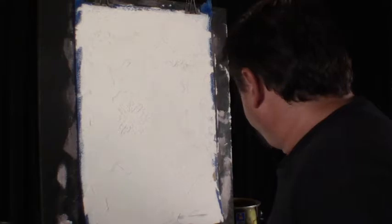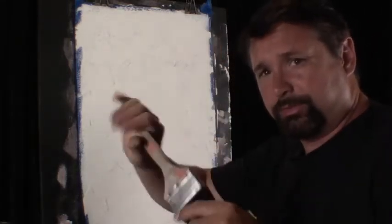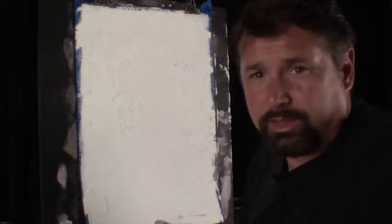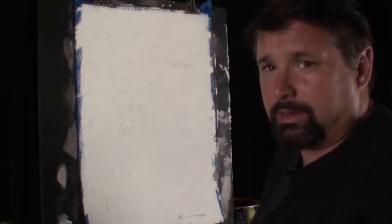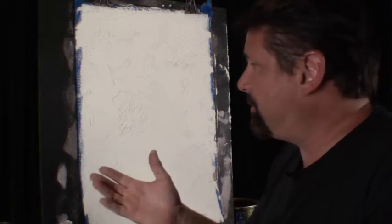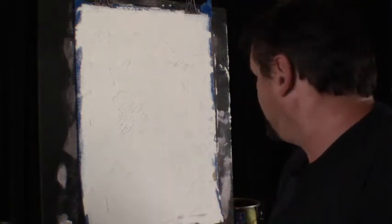Now, the next step, my black nylon bristle paintbrush, Purdy Peacock, my favorite brush. I'm going to use my classic wall glaze. The reason I'm using the classic wall glaze is it's a wall, and I can tint it with paint. If I was doing a room, I'm going to be doing a large surface, so I want to use a lot of glaze. So when you go between the two glazes, the scumble glaze or the wall glaze, cost comes into consideration. I get the exact same performance out of the classic wall glaze.